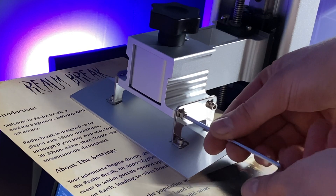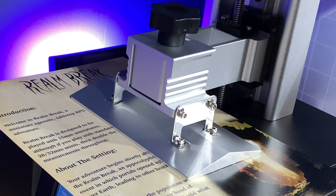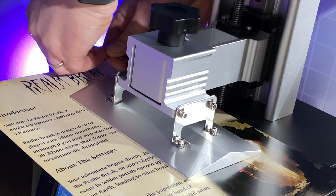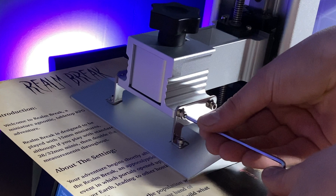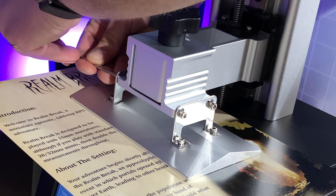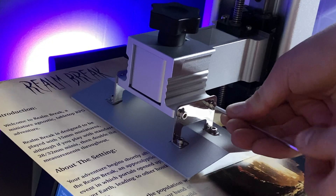When I've been using card or something like that I found it works perfectly every single time. Once leveling is done it will ask you to tighten up those four screws — tighten them all until they're just at that biting point, then go back and do them one by one on alternating sides. If you do both on the left-hand side of the build plate it can sometimes knock it slightly out of alignment, but taking them to that biting point and slowly tightening them gets you a really nice level.